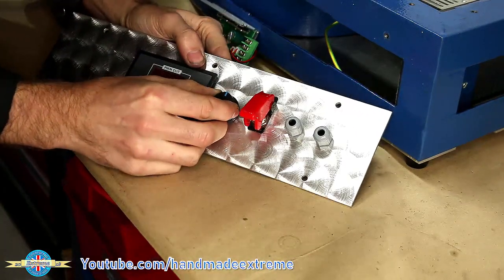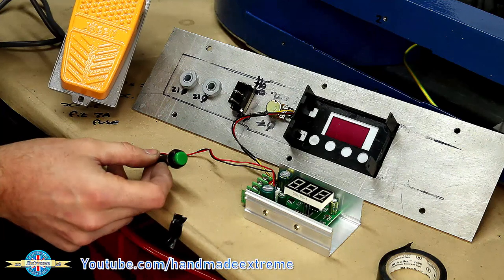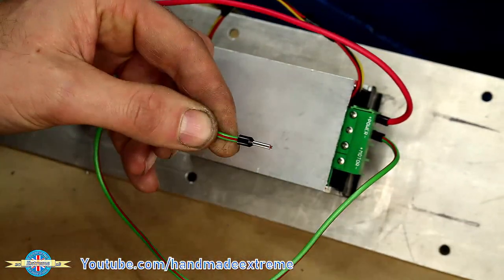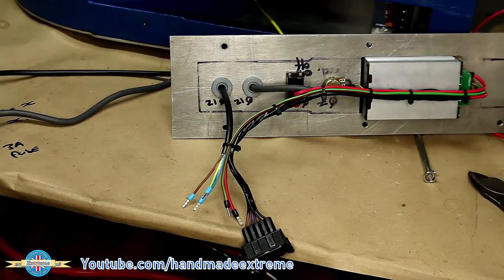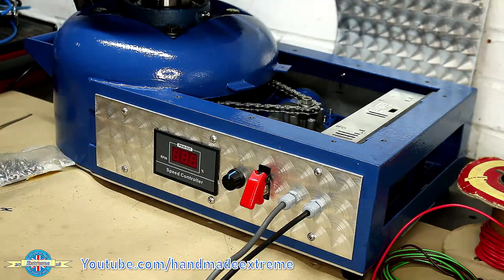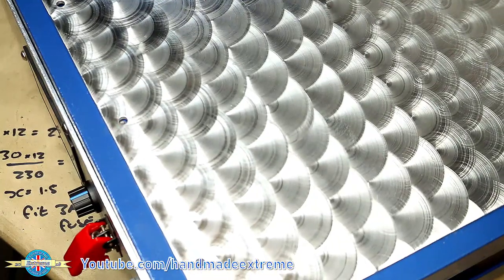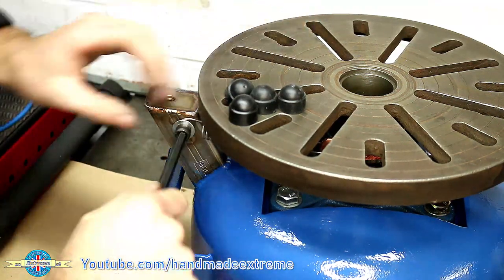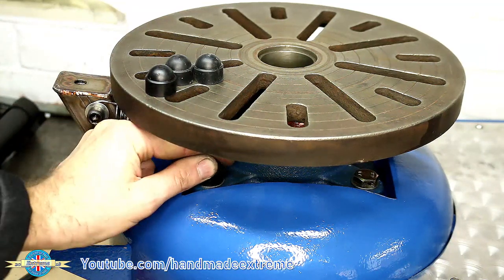And there's the little knob for adjusting the speed. The speed controller came with a button for switching it on and off but I'm going to replace it with this foot switch to make it a little bit easier to use. So a little bit of soldering, a little bit of ferreling of wires and crimping, a little bit of screwdriver work — and we've got a nice neat little loom ready to go into the rotary table. The covers just go on with some little button head screws, and that's the motor connector. On with the cover — there's the earth strap. Stretching the spring to get some preload on it, just nip that up. And I've also got these little plastic caps just to go over the heads of the bolts, just to finish it off and make it look a bit neater.